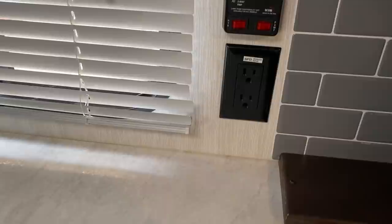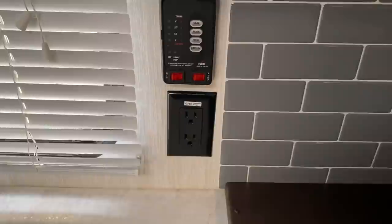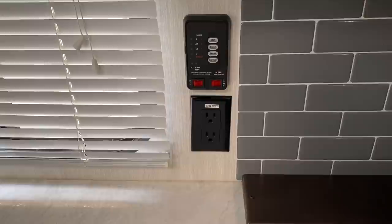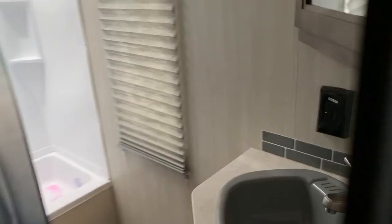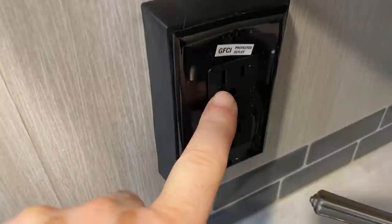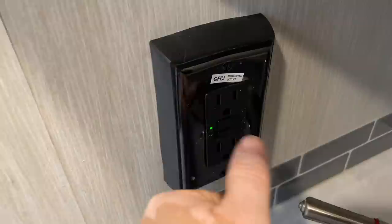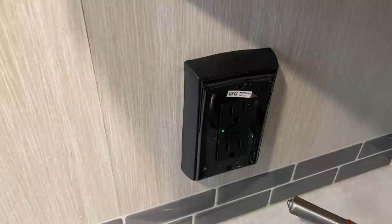On one occasion I lost power to this outlet. I realized it's a GFCI-protected outlet, but you can't figure out how to reset it. I even took the outlet out of the wall, scratching my head — then it dawned on me that the circuit must be chained to the other GFCI outlet in the bathroom. Sure enough, that one has a reset on it. If one of those outlets trips, both outlets stop working, and the reset is on the bathroom one. I reset that outlet and the problem was solved. I wish someone would have told me about that.